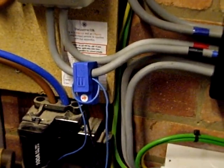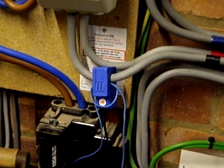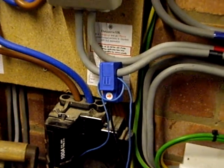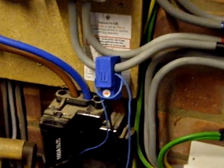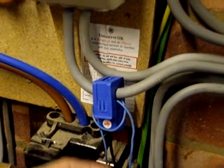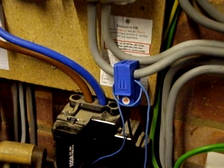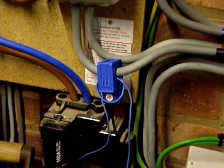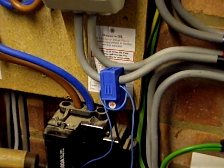We're monitoring as normal the neutral wire coming into the house. Unfortunately it's not as pleasant a day as we would like — we're not generating any surplus PV. But there is an easy way to check that the system's working, which I've shown before: you run an extra core of power through your CT. This is mains power coming out of my house, but by running it more than once round the CT, the effect of that electricity coming in from the mains is more than compensated for by the power going out.